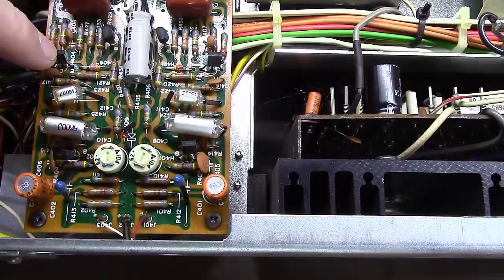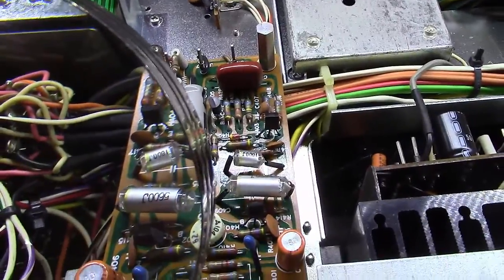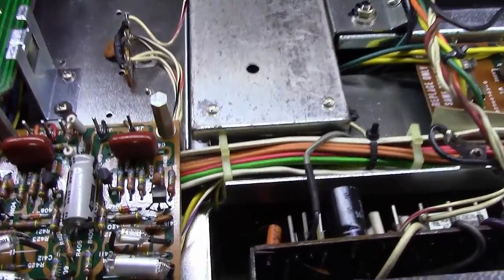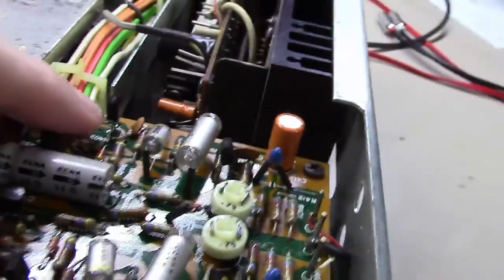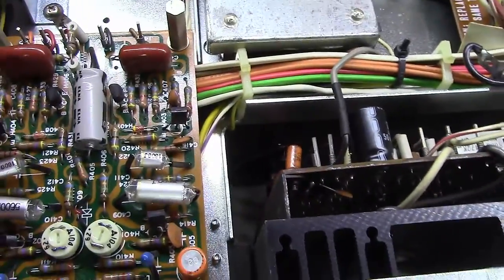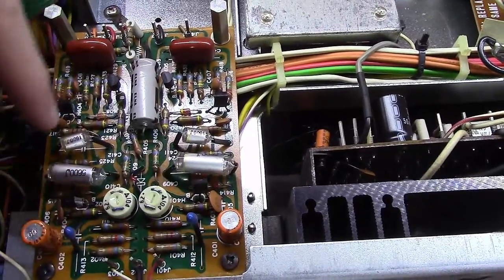And then we have the four transistors right here. These are C1344 transistors, which stands for 2SC1344s. All four of these are the same thing. I was reading a forum one time and it said any time you see a transistor that's shaped like a shed house, replace it. And I would agree with them. These square with little beveled notched face transistors like this historically have not held up well. They get leaky and they get noisy. So we're going to replace all four of these today.